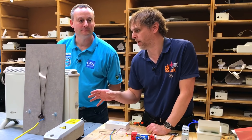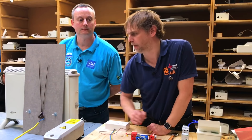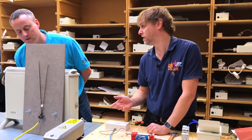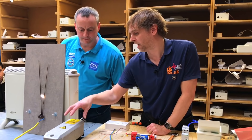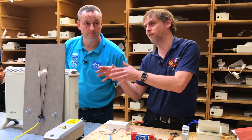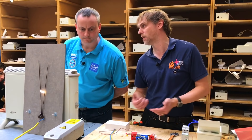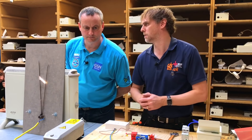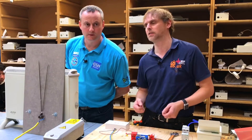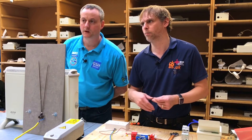This won't trouble your circuit breaker because it's just a load for the transformer - there's no overload on the incoming supply. It won't trouble your RCD because it's not a fault to earth. And it won't trouble your AFDD because it's not on the distribution wiring - it's isolated by the transformer onto the load side. So even if you have an AFDD and some kind of fault on the load side isolated from supply by a transformer or opto-isolator, the AFDD is just not going to notice it. Leave it going long enough and you can actually smell the ionised air - it smells like a photocopier or a laser printer.